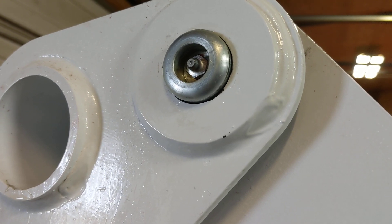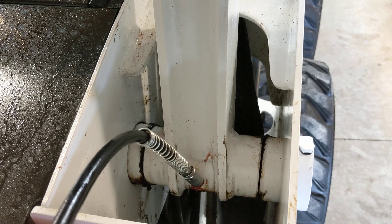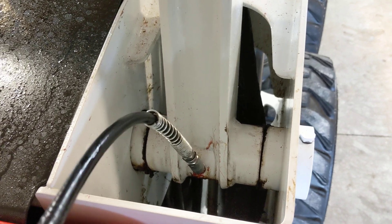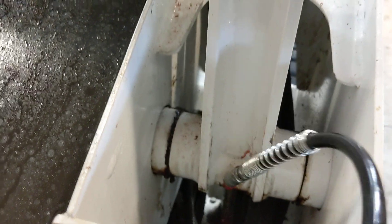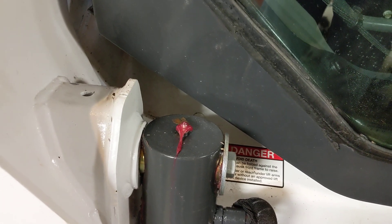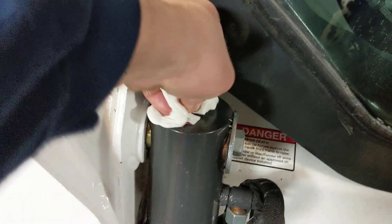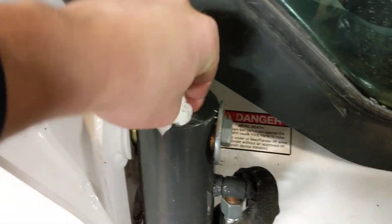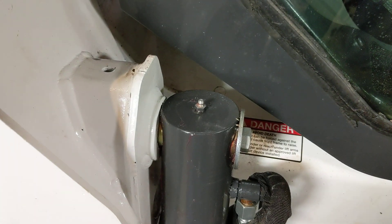This makes a clean passage for fresh grease to come in and expel any contaminants. Generally, about two pumps of grease is sufficient, but I grease it until you can just start to see it oozing out of the joints. To prevent dirt and contaminants from sticking to your grease points, I recommend wiping off any excess grease and removing it — it's cleaner for the next time.